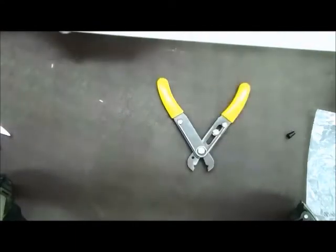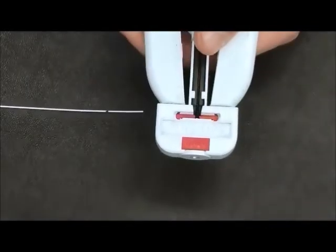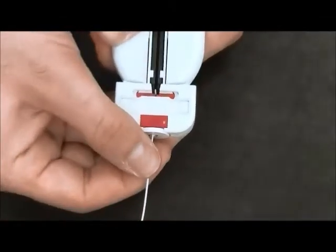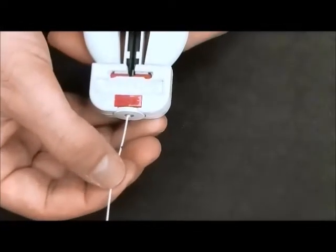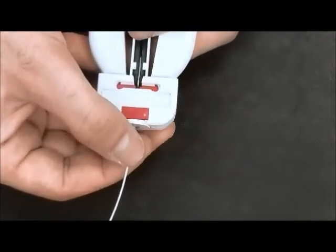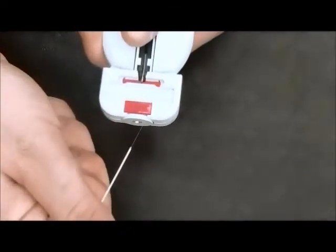When stripping the buffer off the fiber optic cable, you can either use regular strippers or you can utilize the thermal strippers. When using the strippers, go ahead and feed your fiber optic cable through the strippers. You can either take a little off at a time or you can feed the cable through the strippers until you see your line and go ahead and strip it off all at once.